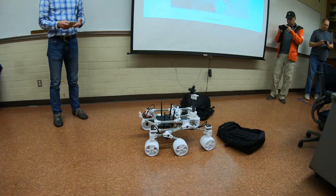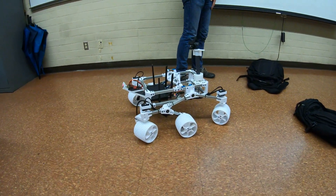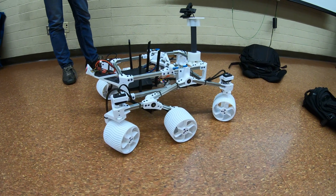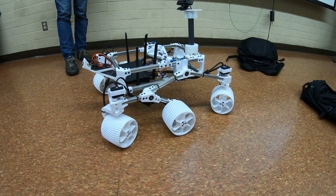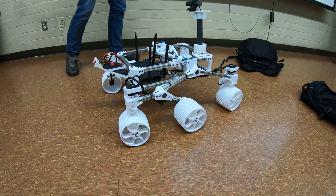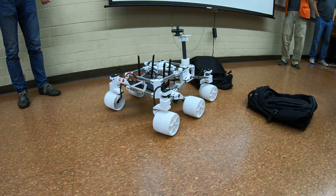So Robert, what material did you have to use for your 3D printed parts? So most of what you see here is PETG. Earlier it was PLA — it was easy to print, it was fast, but sensitive to temperature. One of my outings was a demonstration outdoors in the summer, and the PLA started softening.